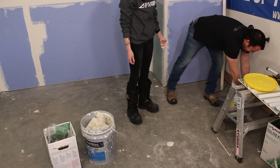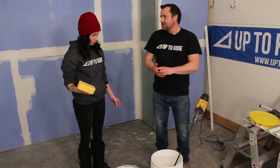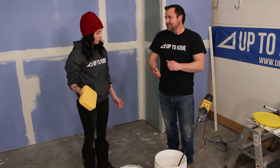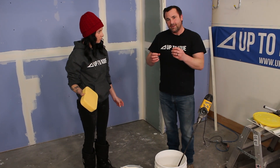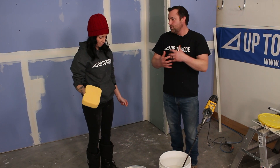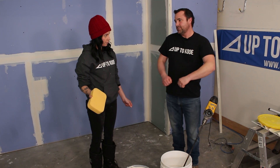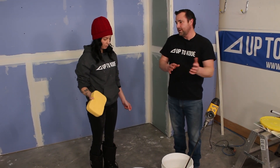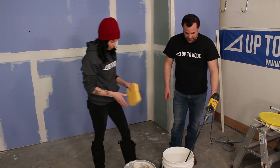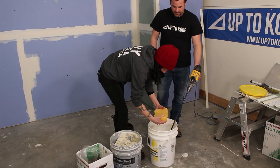Good question on the amount of squishes. Because we're doing first coat, we want the mud fairly thick — fluid enough that it's easy to work with, but thicker means less water, therefore it'll shrink less. That first coat we want to fill it up and get a nice shape so that the second coat can be done cleanly. We're trying to avoid a third coat — more steps, more time. So just do two squishes and I'll do the spinning.